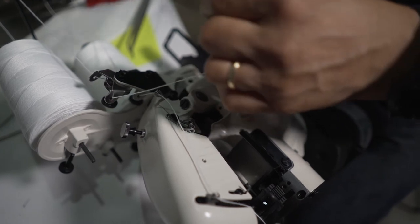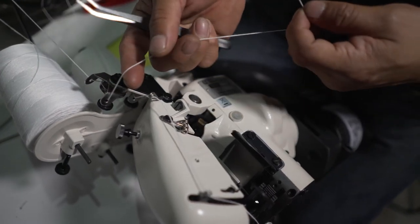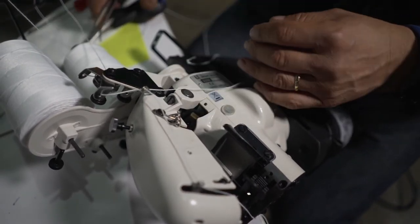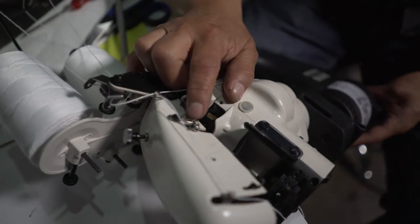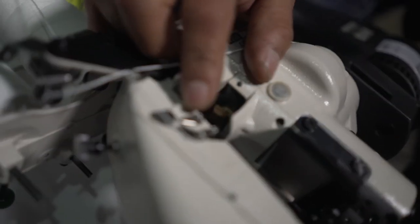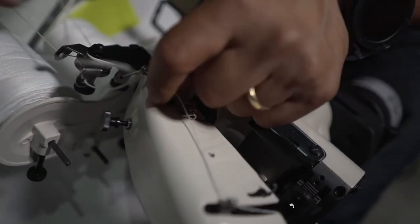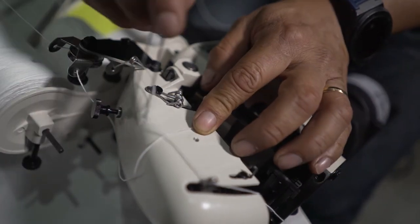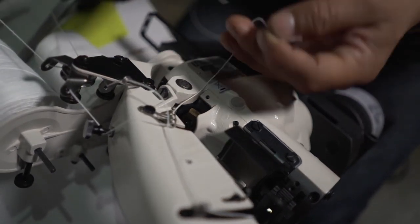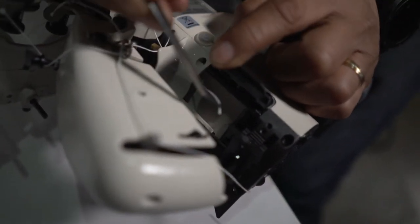Same thing, you're gonna use this tension that is on the very top. Once you pass, keep in mind, the tension is very light, it's not tight, very, very light. You see this one, the easy way is to align these three eyelets. If it's on the bottom like this, for me it's aligned like this. So I pass the thread in just one shot. And after that, this one guide over here, screw two. So I'm looking at the thread over here.